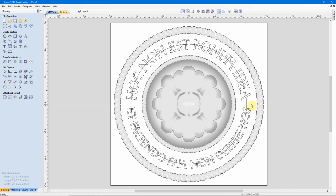Now that I'm finished with this, I can get rid of these two arcs because I no longer need them. I'll select one, hold down SHIFT, select the other, and tap DELETE. That is it as far as the design is concerned — I'm ready to start calculating toolpaths.